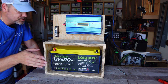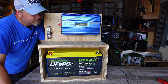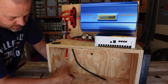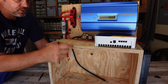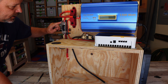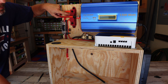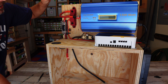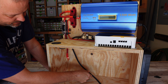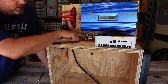Once it's all done I will show you folks a close-up view of how I wired everything up, and then we will test it out. I still need to get some casters, so onto the wiring. This is going to be where the battery unit sits. I've already got the positive and negative cables fished through a hole in the top of this shelf. The positive cable goes up through a hole into a 250-amp inline ANL fuse from Install Gear, then out of the fuse directly into a lug on the positive bus bar. Another lug from the positive bus bar goes directly into the inverter.